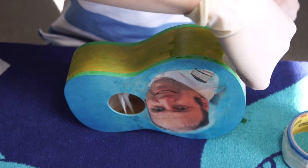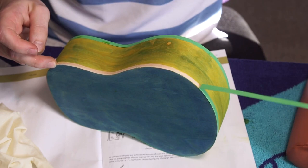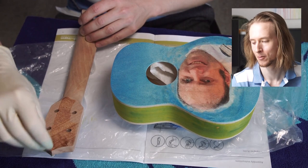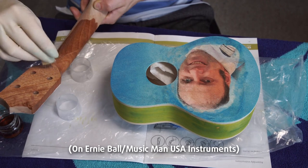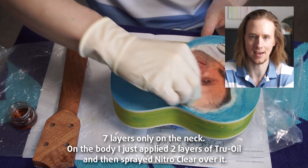I've accidentally applied it a little bit too wet here, which could cause the dye to bleed under the masking tape — but luckily it didn't. Now I'm taking off the masking tape and we get this stripe of natural wood. Now we start finishing with some true oil, which is a kind of boiled linseed oil finish. I apply one layer every 12 hours. This true oil is mixed with one third white spirits — mixing in white spirits is supposedly what they do at the Music Man factory. I cover the whole surface and then wipe off the excess immediately, doing about seven layers.